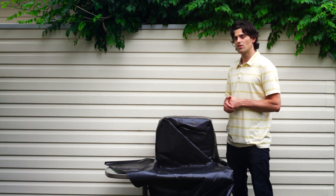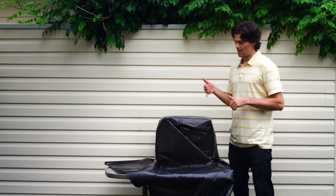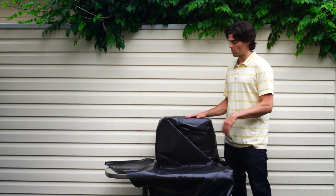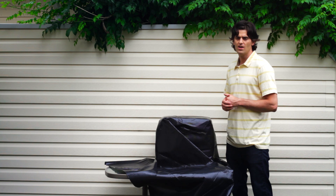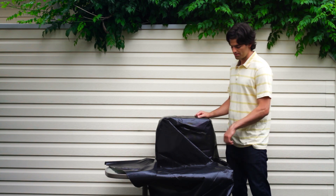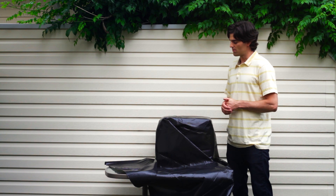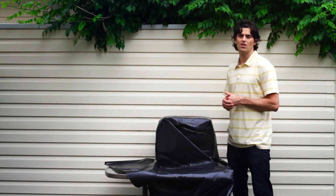It's about three times stronger than EPDM rubber, so in most cases unless I'm doing something really tight and small, I still like to use the RPE liner. When you get into something really big with fewer shelves and 90 degree corners, that's where I almost wouldn't even consider the EPDM anymore — just because RPE is way lighter, way stronger, and you can get it in way larger pieces. We've made single sheets up to 60,000 square feet, so you can install a very large piece on site in a couple of hours with no seaming.